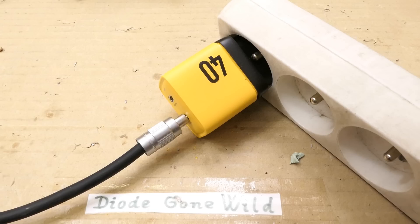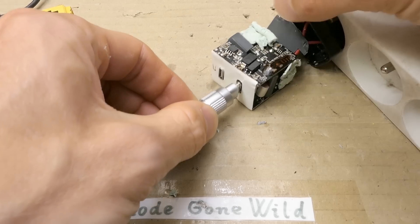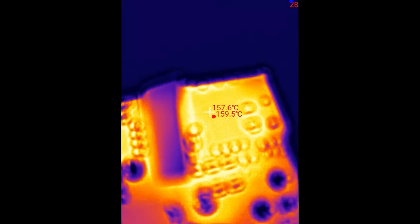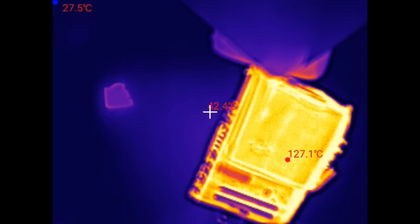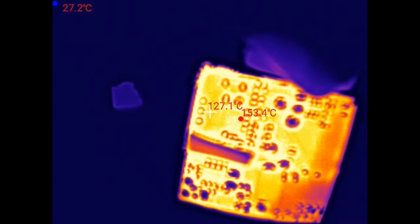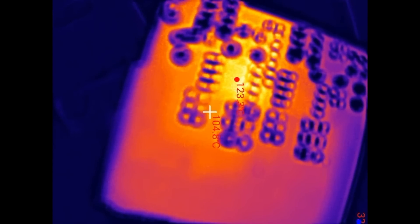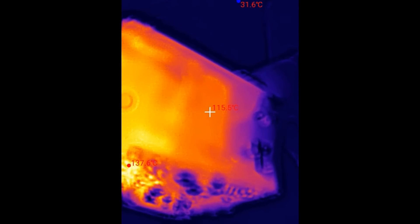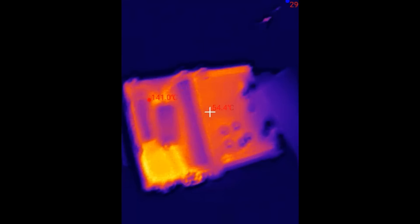It has been running for two hours loaded at 40W. I'll open it and quickly look with a thermal camera — don't try this at home. Let's unplug it, pull it out, plug it back in, and remove the cover. The primary switching chip is 158°C — and that's the surface; the actual silicon has to be even hotter. There's another chip at 136°C. The transformer is 128°C, and it's already cooling down after being taken from the box. On the secondary side some chips are at 123°C. The primary electrolytic capacitor is 116°C, a polymer capacitor is 111°C, and another about 100°C.